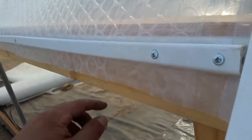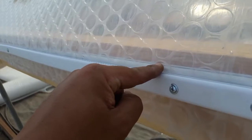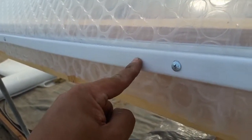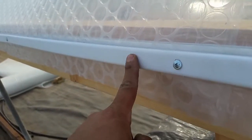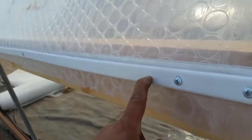To prevent leakage, the film comes down and ends on the top of the first termination, which is the connector for the roll-up. And then we pinch it down with another piece of extrusion. In this case, we're using our narrows just for aesthetics, nothing more. You can actually use old wiggle wire track, pieces of wood, whatever you want for your termination piece.